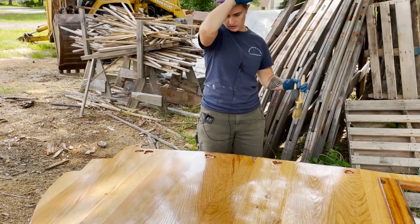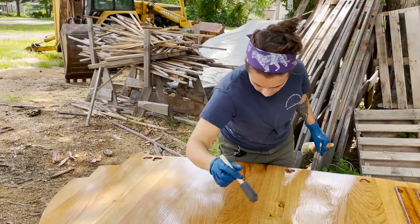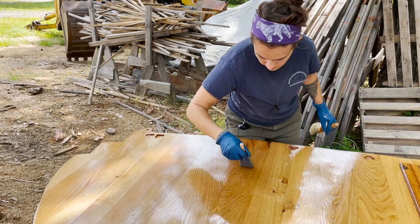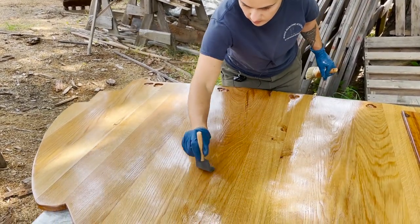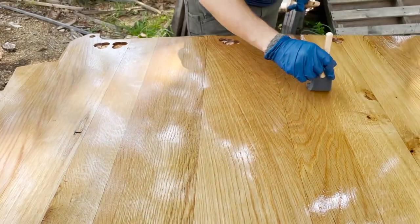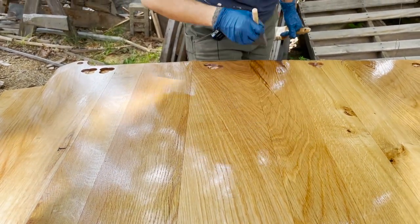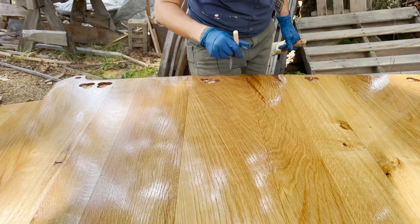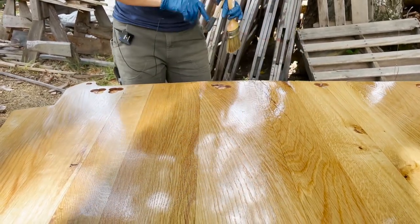So why we're doing this process with the two sealer coats and then the two coats of varnish, mostly because that's what the product says to do. Always read your cans. People at Total Boat put a lot of research into this, so that's what their process does. You fill the pores with the sealer coat, and that bonds deep into the wood. It flows into the wood. It's thinner.